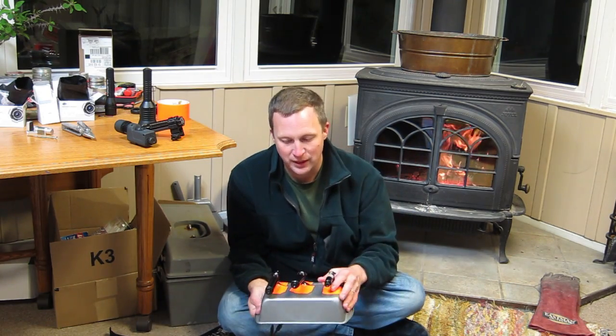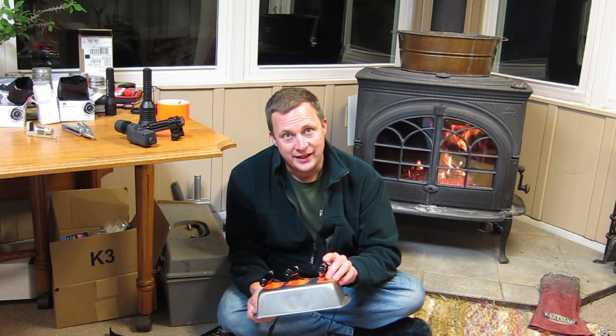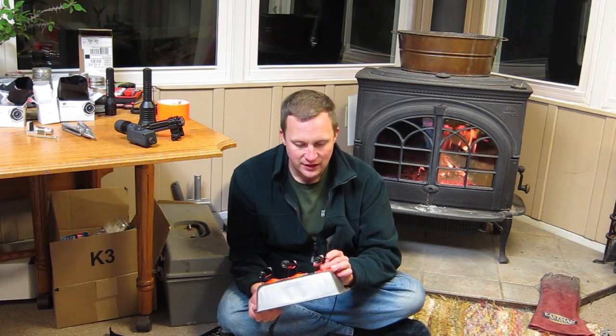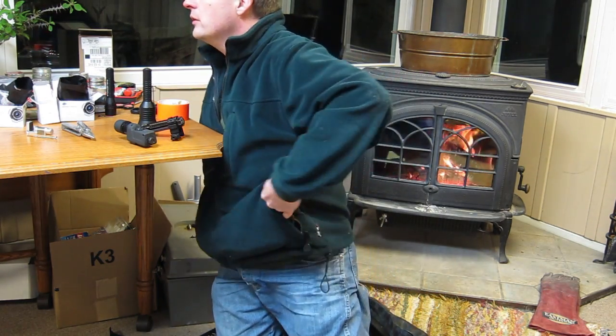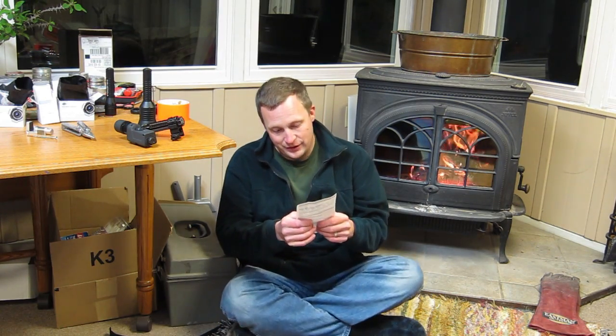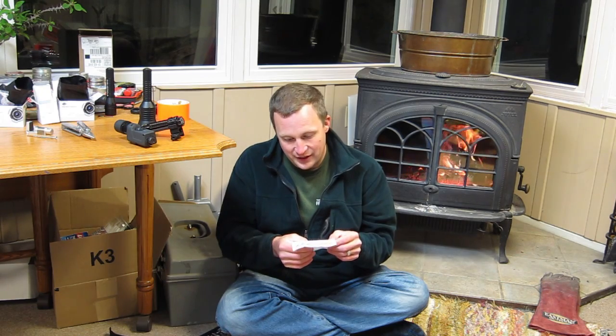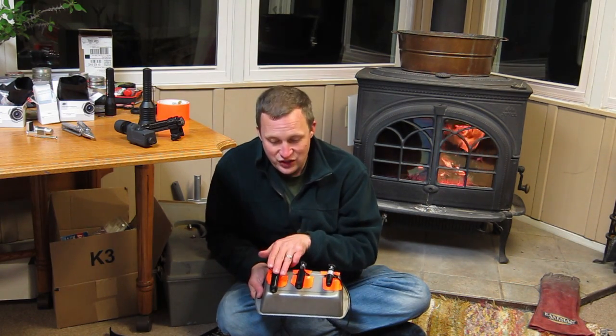There's a little joystick on the back of these to get in and out of the on-screen display where you can adjust different settings. This little E190 is a KTNC camera using a Sony X-View chip — specifically the Sony X-View HAD CCD2, the 960. You get up to 1020 horizontal and 508 vertical resolution — good resolution.